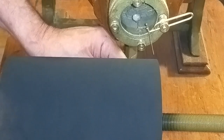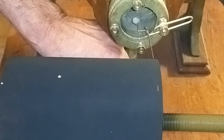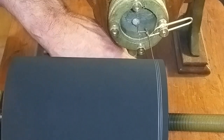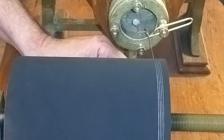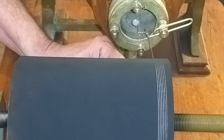I've just reinstalled the mandrel on the machine and I'm going to slowly adjust the stylus. I'm trying to get this just as light as possible but still leave a nice, clean line. So these are going to be my control grooves — those are unmodulated, as you see. And that looks like it's going all the way around.